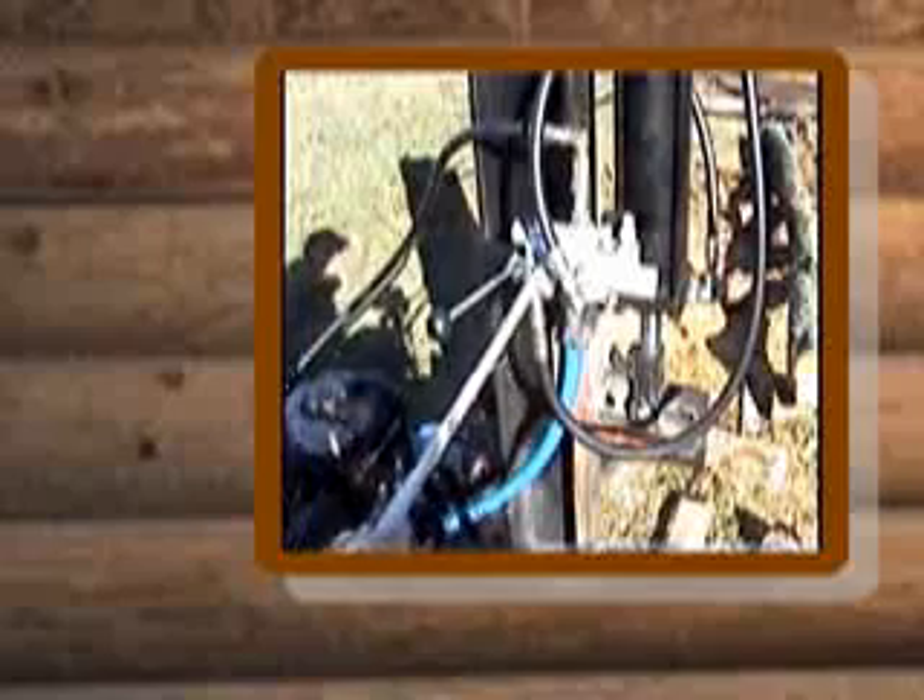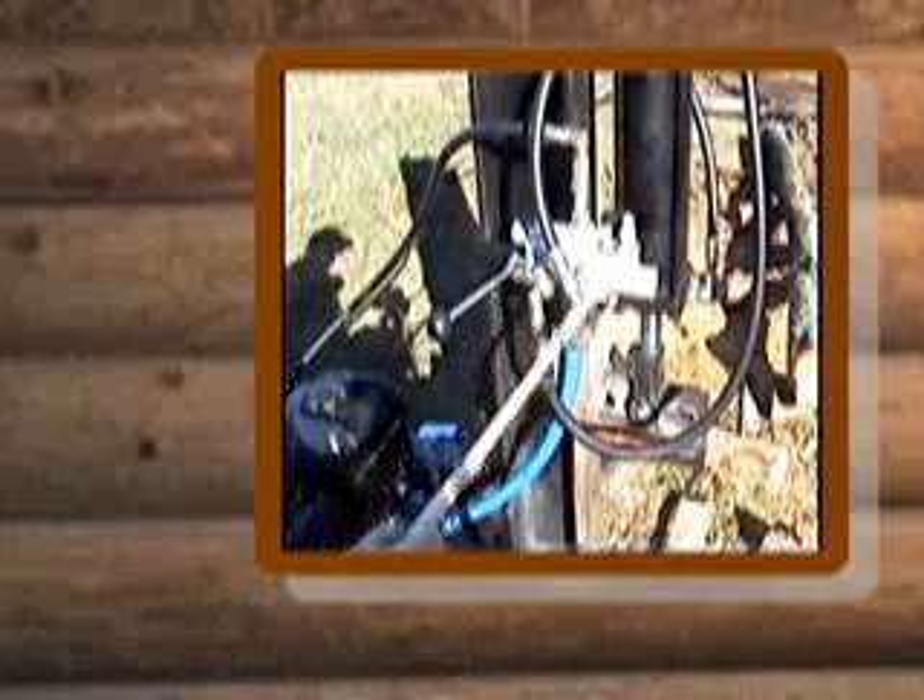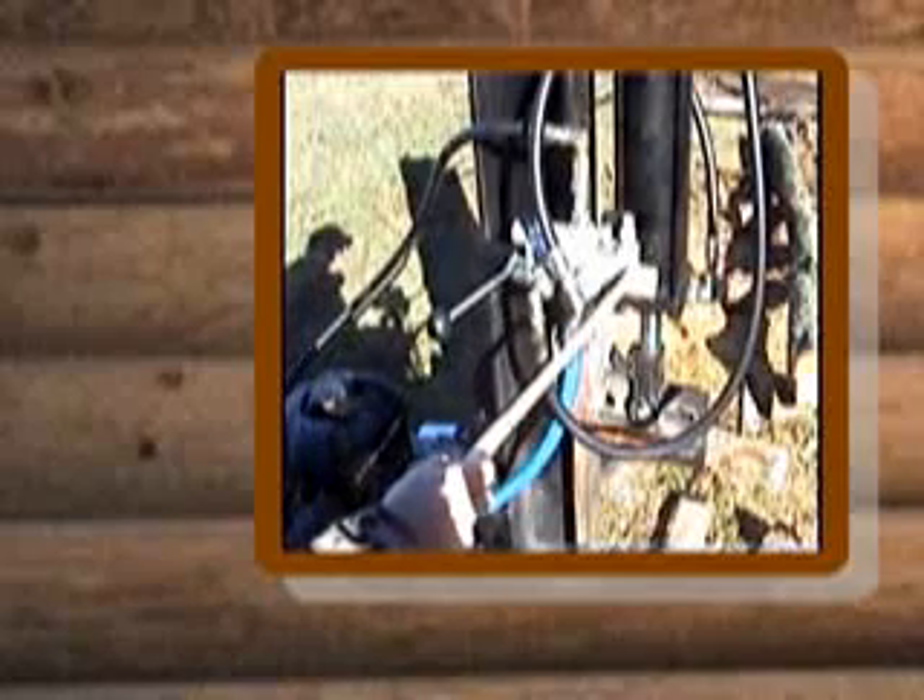You've got an A and a B on your hydraulic valves here. The A will go all the way up to the back of your cylinder and the B will go to the work side of it — the front is always the work side. I've got three-quarter down to three-eighths here with some 90s on it.